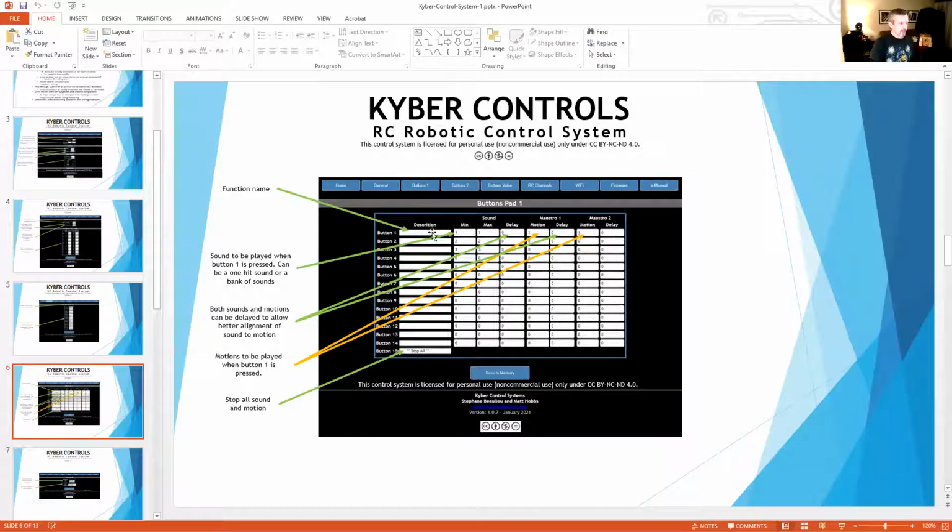And then you can do that for all the buttons that you have. So if you want, in seconds, or if you put like 0.1, how does that work? You just enter it in milliseconds. So if you want a second, you would just put 1,000. Oh, okay. And then that would give you a second. Gotcha.